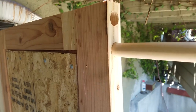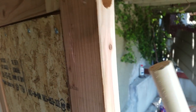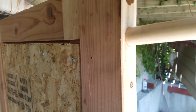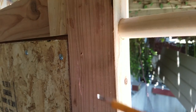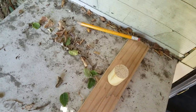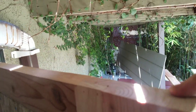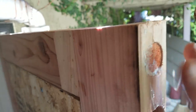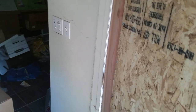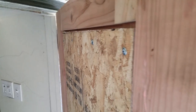Let me show you how I fill these holes. I buy 1-inch dowel because I'm using a 1-inch spade bit. I stick the dowel in there, make a mark, take it out, and cut it. Then I cover it with some wood glue, just glop it on there, and stick it in. You can wipe that off with a wet rag. Those are sealed up — they're not going to rot and they look pretty nice.